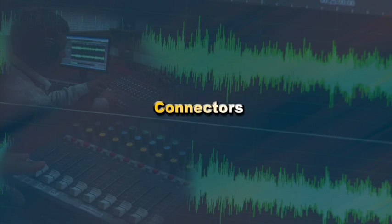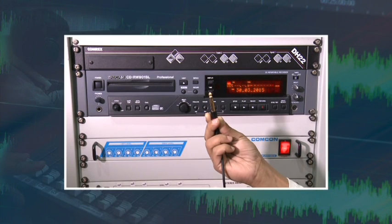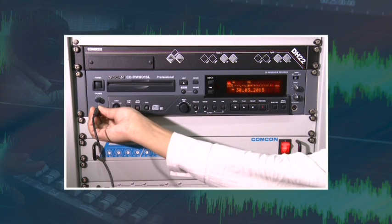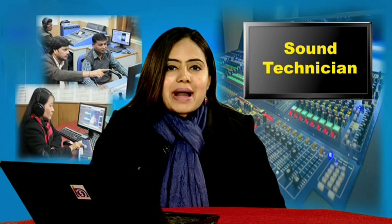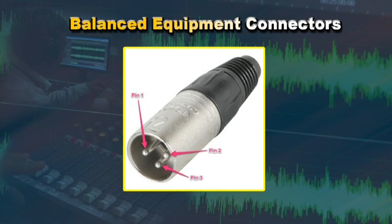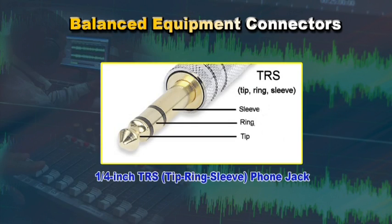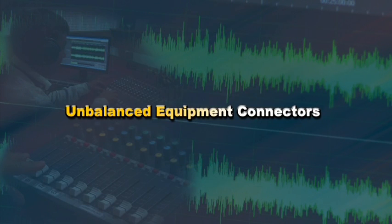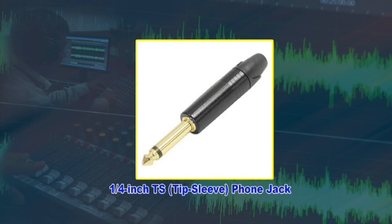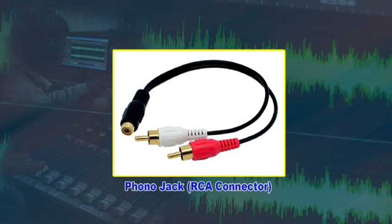Now let's talk about connectors. Recording equipment also has balanced or unbalanced connectors built into the chassis. Balanced equipment connectors are of different types, that is 3-pin XLR type connector, 1/4-inch TRS tip ring sleeve phone jack. Now let's move on to unbalanced equipment connectors. 1/4-inch TS tip sleeve phone jack, a phono jack RCA connector.